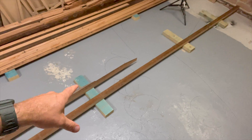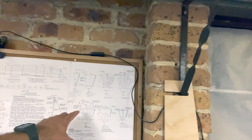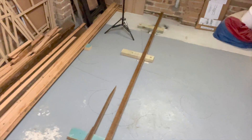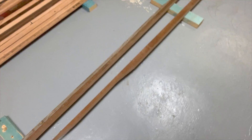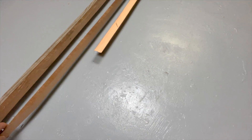So it turns out I jumped the gun thinking I'm ready to start setting up the bulkheads. I still have to put the framing on the transom. So I've got that all cut out. The joinery is done. I just need to get my epoxy mixed and I need to scarf my deck stringers. So these go up in these positions here, and they're 2 inch by 1 inch, or about 45 mil by 22 millimeters. I've cut some long scarves in them, as you can see here. So they need to be joined.